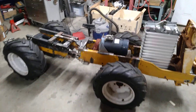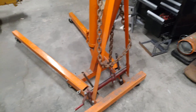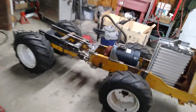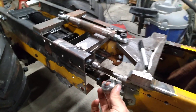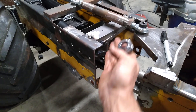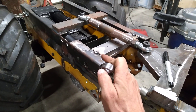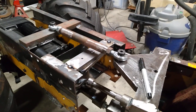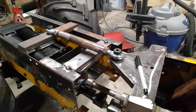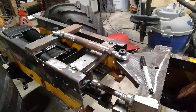Last time we talked about the cub — we were talking about my steering linkage. Let's back up a bit. I had this little guy in there, and the reason I wanted him in there is because this is obviously solid to the frame and square-ish, parallel sort of. The link on the other side has heim joints on both ends, so it doesn't really matter how square or parallel that link is because those heim joints will take up any deviations or slack.